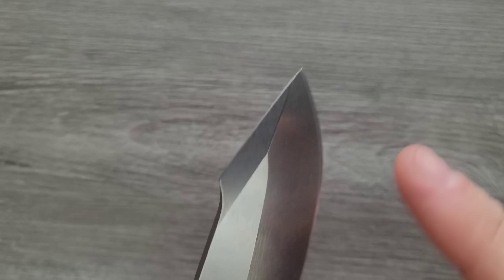This side is much the same as the front except you have the two screws holding in the countersunk steel liner lock. Lockup — it's solid, absolutely not going anywhere. That's partially because we have the exterior stops, which mitigate pressure away from the pivot and really tighten up the lockup. The lock bar is locking in at about 60-65%, something like that. There's a little bit of lock stick, which is annoying. Centering is coming in pretty much dead on — the tip might be ground slightly to one side, but the blade itself is actually centered.